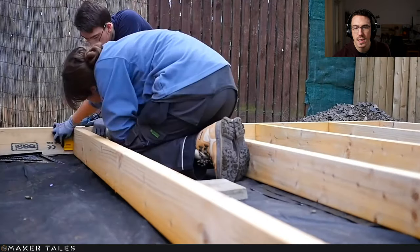See, here you can see that I have the damp-proof membrane on all the sections where it is actually touching the ground. And right here, I've already dug away, so there's a good centimeter or an inch, or sometimes 2 inches, where there's just sort of airflow.